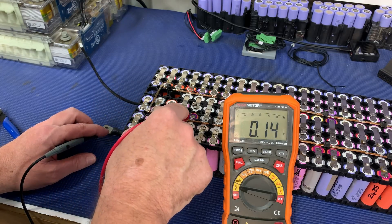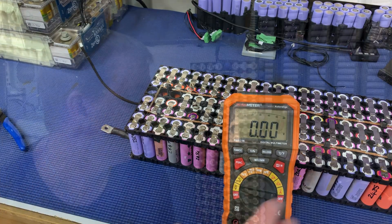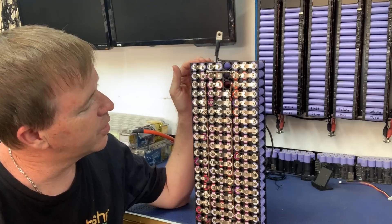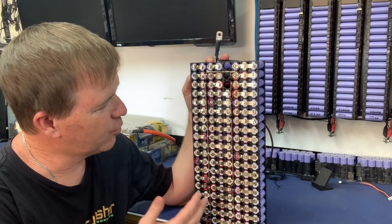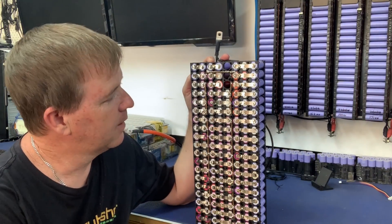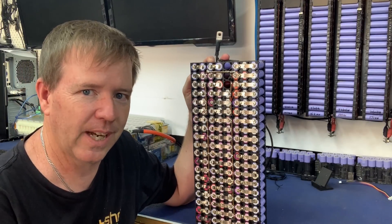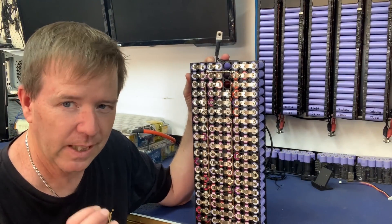I'm very glad we found that — we can put it back into service quite quickly. I'll just remove that cell, put a new fuse on, and away we go. So we found the bad cell at 0.2 of a volt — it's definitely that Sanyo cell that was self-discharging and drawing the whole pack down, which is a real shame. This leads me to believe that this routing for several cells with nickel strip is probably not ideal. I like the idea — it's really fast and there's less heat into the cells — but moving forward, this will be the last time I do it this way. I need to get a better method.